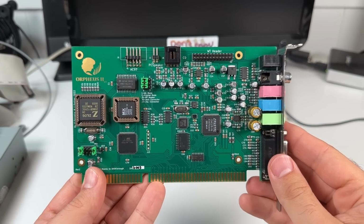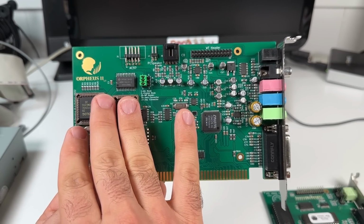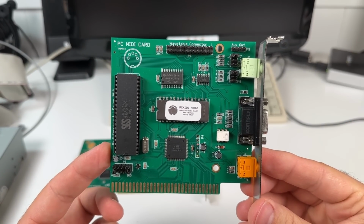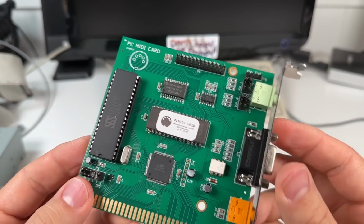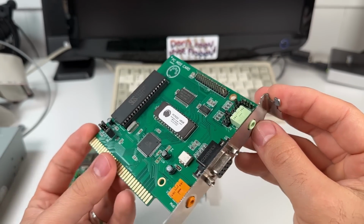The LT is essentially two cards in one, a Sound Blaster compatible card and a PC MIDI card integrated into the same PCB. Edro and Leo's PC MIDI card is a fantastic product that I bought a couple of years back, and I'll include a link in the description to where you can learn more about it. Although the components on the PC MIDI look a little bit different, they all exist in one form or another on the LT and serve the same functions.